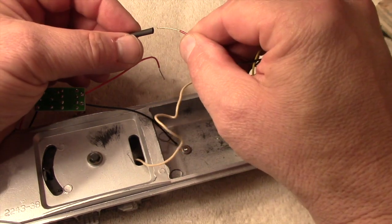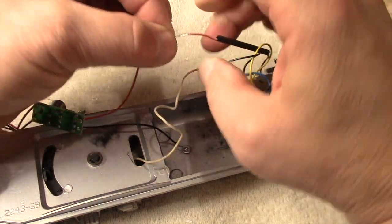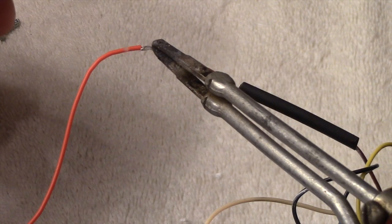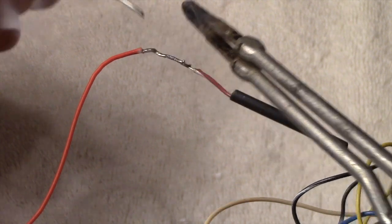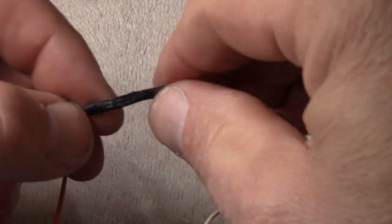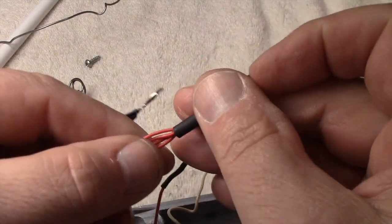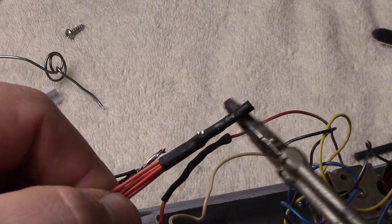Before I make the final connection, this is the red wire from the pickup roller. I slide a little bit of heat shrink insulation tubing over the wire, then connect that roller wire to the AC input — the red wire on the bridge rectifier. This connection is also going to be soldered. Once that's complete, I'll slide the insulation back over the exposed connection and use my soldering iron to heat it up so it shrinks over the exposed wires. I could use wire nuts to cover up the exposed wires here, but instead I'll use more heat shrink insulation — I think it gives a nicer, more factory appearance.